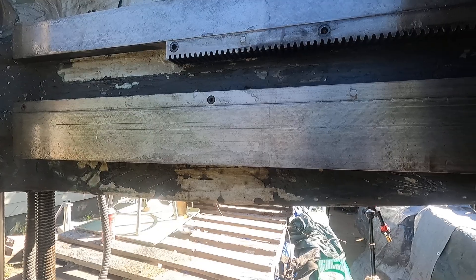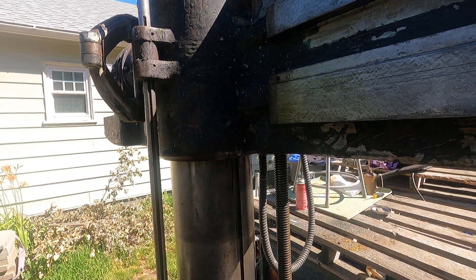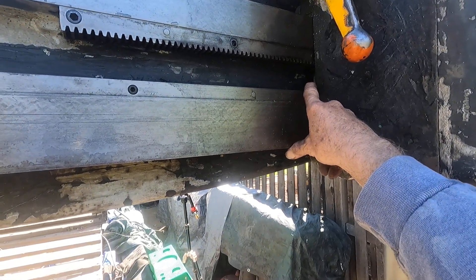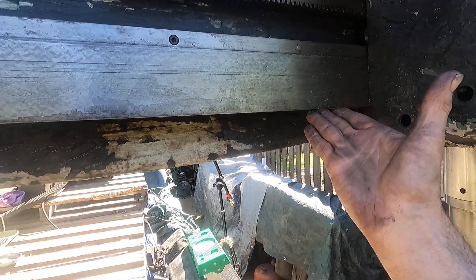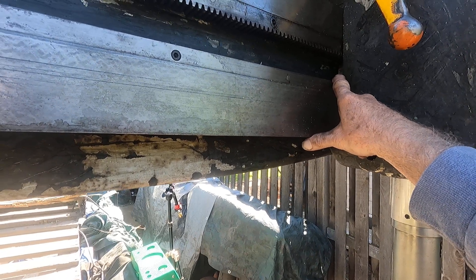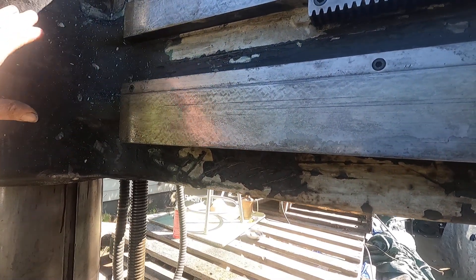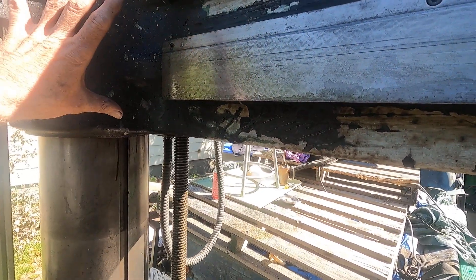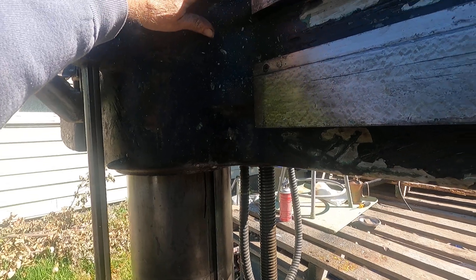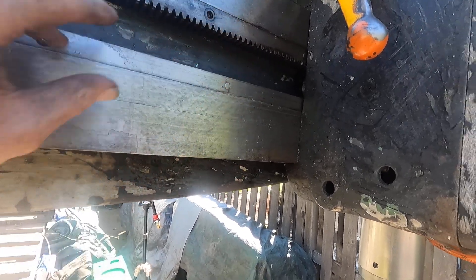I'm thinking of just sliding the head off the machine to do it, but I'll have to think about that. Those bearings got stuff under them and locked the head, pulled it up into the lock position. When I burnt the final bearing and knocked it around with a punch, the head just went clunk and then it could move. Before that, I had to move it over with planer jacks. I even ground places here where I could get the jacks in to push the head over enough to get in there with a torch and burn that bearing.